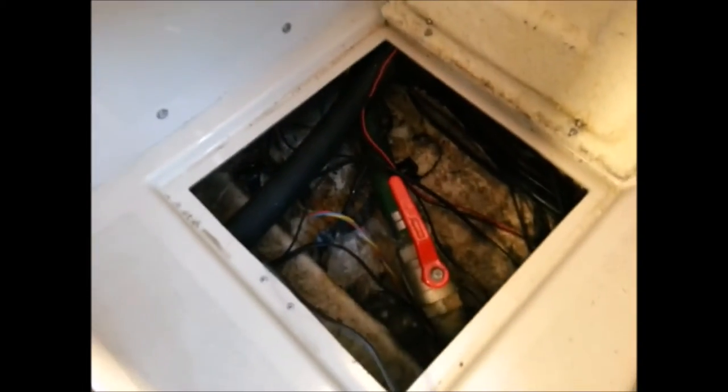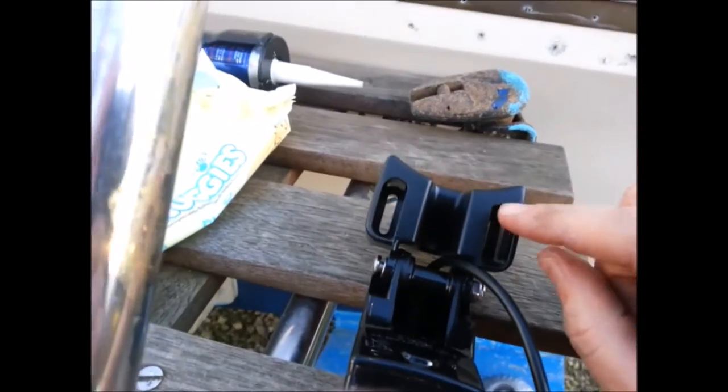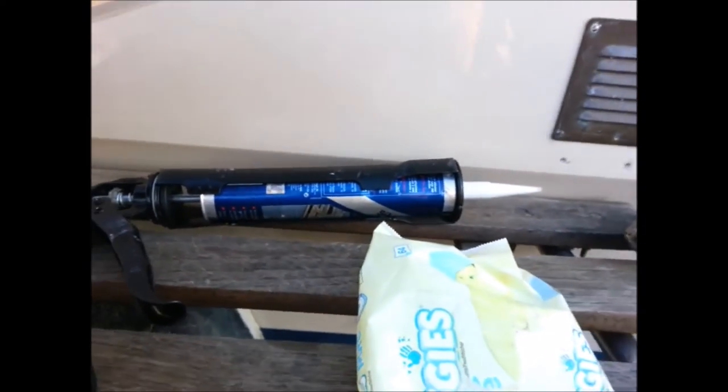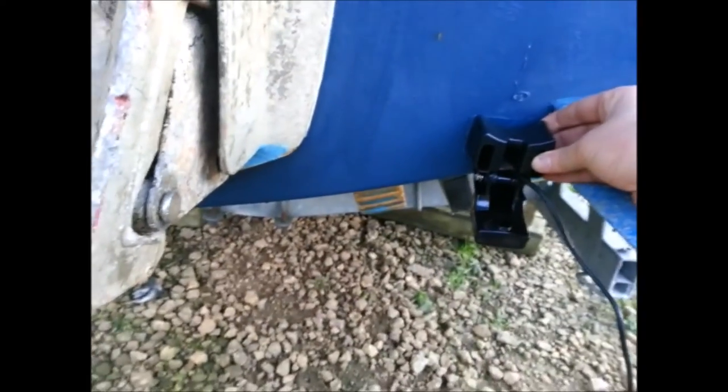Down where those wires are, under here, we're going to go through here into the engine bay, and one's going to go up to the transom on the back for the different instruments. This is the old transducer of the old fish finder — here's the new one. Fortunately, where the four screws go in is exactly the same as on that one, so that saves me drilling any new holes. I've got my Sikaflex to put in the screw holes, and the transducer will just be hanging off the back like that, not too far down.